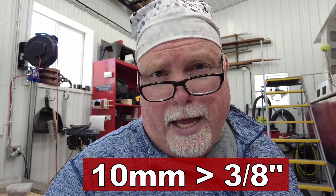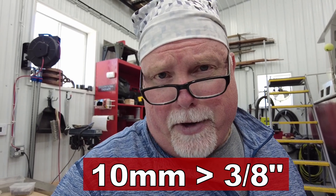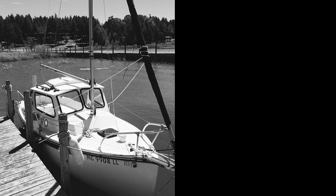When you're dealing with other areas of the boat where the hull does not have coring and isn't that thick, you've got a problem. The Albin 27 hull is approximately 10 millimeters thick — about three-eighths of an inch — solid fiberglass. There's nothing to screw the blocks into when your hull is only three-eighths of an inch thick.